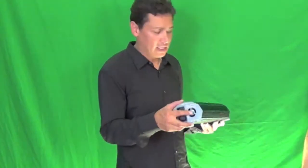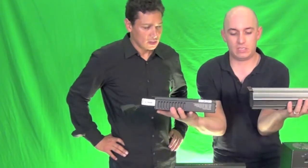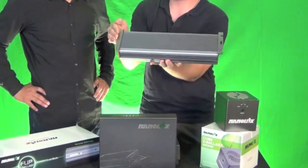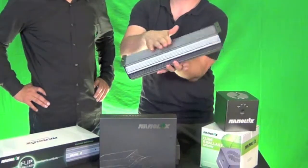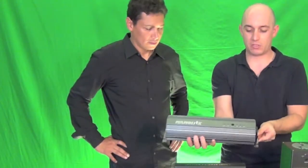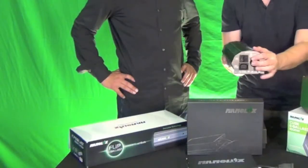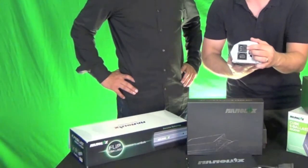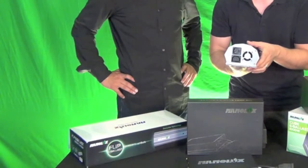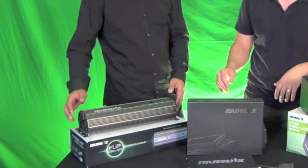There is a fan on it and a passive intake through it. The new mounting bracket sides of the flip ballast are raised slightly, so it won't sit flat against the wall — it creates a little air gap, which is great. It has standard keyholes to mount onto the wall and an integrated replaceable fuse inside. For folks who have had ballasts that needed fuse replacement in the past, you have that option available. That's the NanoLux flip ballast.